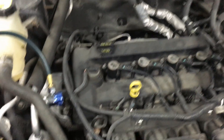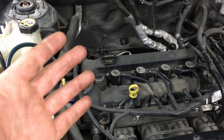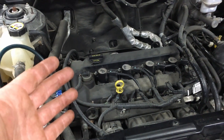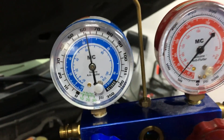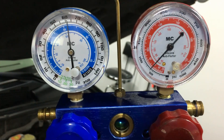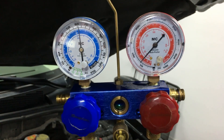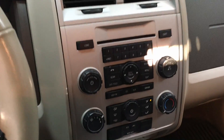Start the car — the pressure's coming on, the compressor is spinning, it's not turning on and off. It's definitely running. The problem still is refrigerant, because static pressures to the untrained eye mean nothing. I've got to push that point because I see people make this mistake all the time.